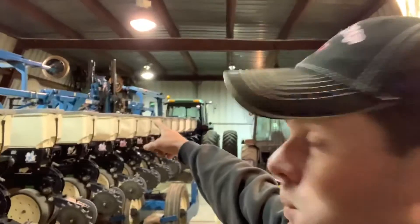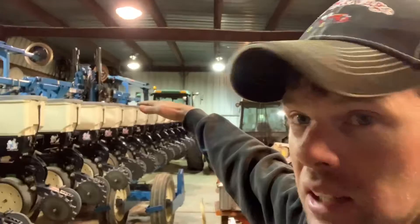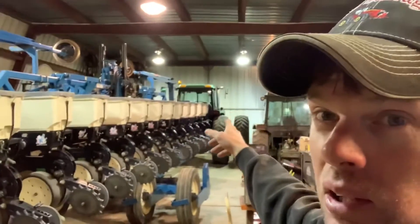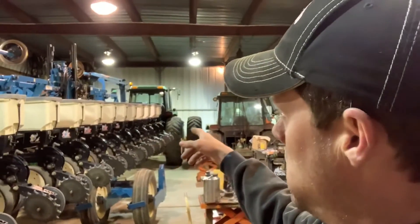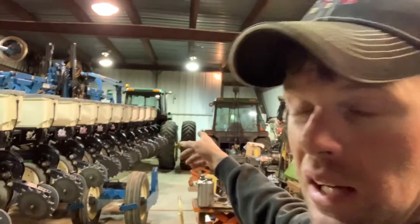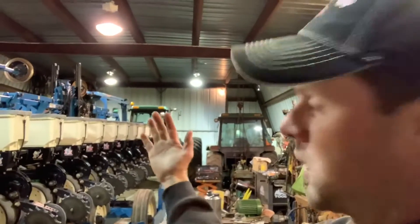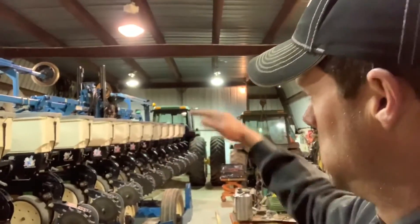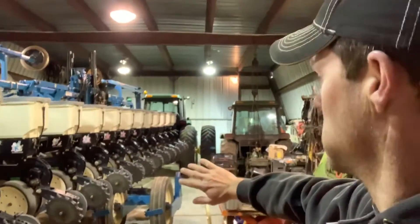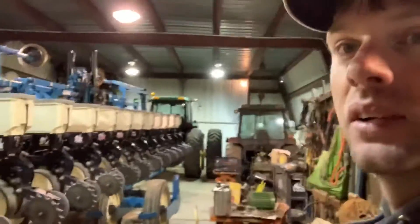With this planter, in the middle there you see a big mass with two cylinders on it. Right now it's raised all the way up. Inside the cab of the tractor you have a remote box with about six or eight switches on it — you work your remote levers inside the tractor with those switches. This planter will turn until all of this is sideways, then you can pull the tongue up half the distance of how long the tongue is, then set it down and you can start planting.